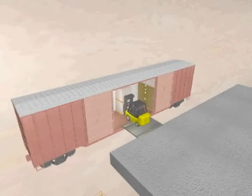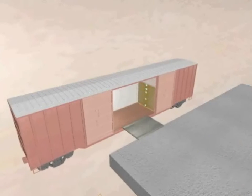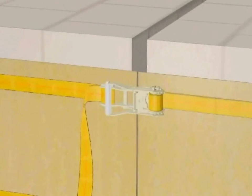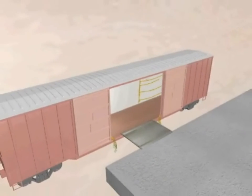When the car arrives at the destination, first unload the doorway. To release the ratchets, move the handle to the unlocked position and loosen and remove the free end of the webbing. Install the webbing supports into the doorpost anchor at the appropriate heights and insert the webbing into the supports to keep it out of the way during unloading. Allow the ratchets to hang outside of the doorway.